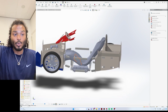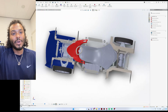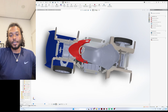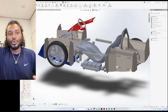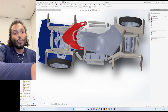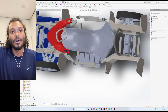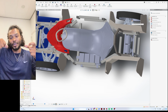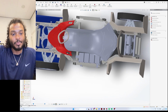So the seat was the first thing I designed, and then the steering wheel came afterward. I made the seat, and then I placed 4 wheels around it, to make the most compact way that I could fit these four wheels. And then I built the frame to suit those dimensions. I wanted the pieces where the wheels are to be as narrow as possible in the frame, so that the suspension arms themselves could be as long as possible. The longer suspension arms you have, the more moment and force you can put through the spring, so that becomes optimal for the suspension.